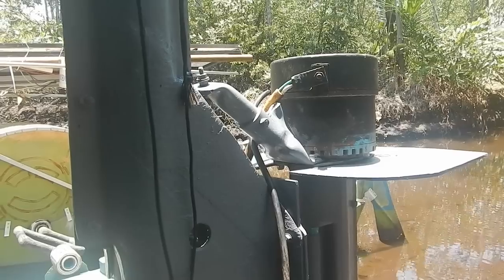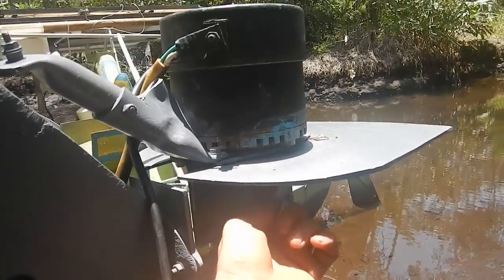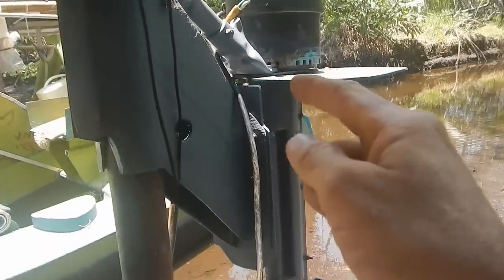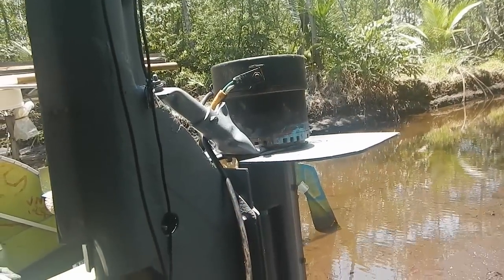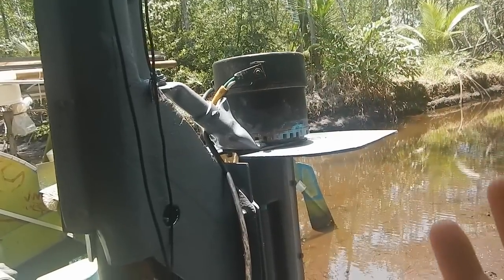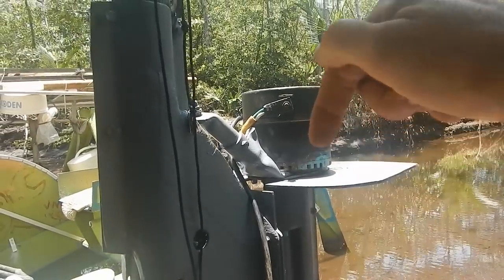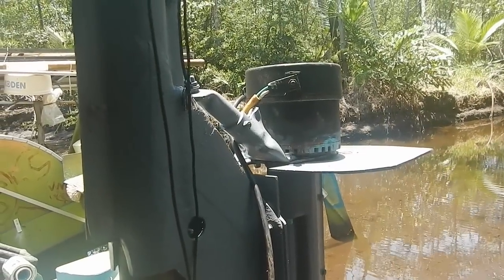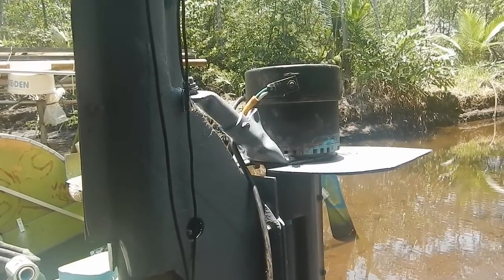I think to get this apart, I take off some screws under here, and then I pull the motor up, and the entire shaft that goes all the way down to here is attached to it. So I have to take that out with it, unfortunately. I mean, it's not that unfortunate. It's just kind of a pain to get that all the way back down in there and lined up right to get into the gears and stuff. But I think I better do it. I can't drive around with this horrible grinding.